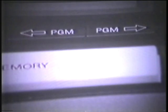The user does have the capability to preview the entered programs or change any or all of the programs, but we will not show these procedures. After entering all the programs, check the edit switch is set to edit. Then set the recorder to the recording pause mode by pressing the recorder button, then pressing the red record button and pause. To engage the actual editing process, press the program edit. Sit back, relax, and watch the edits automatically assemble into the final created video.